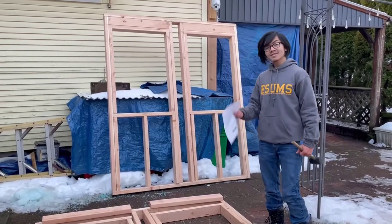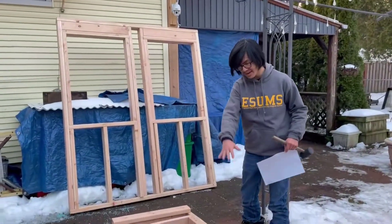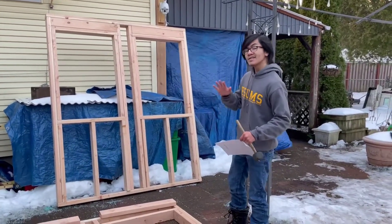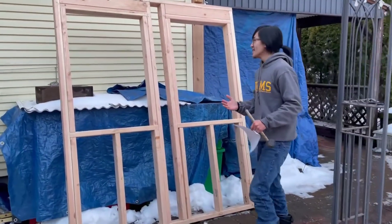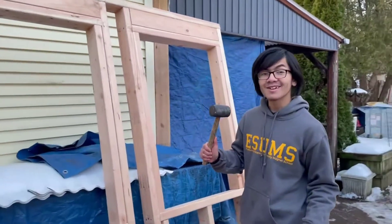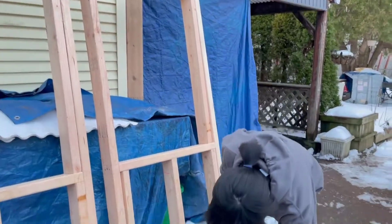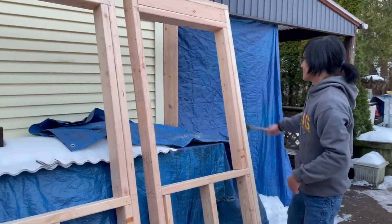So the plan is to install these frames. Right now we could have everything nailed in and set to go, but when my dad built things he usually built them with the foresight that he's going to have to do things alone — which means he needs to carry things and keep them as light as possible. So he designed this frame with the intention of carrying it by himself, meaning we can remove some parts to make it lighter. What we're going to do is knock out all the jack studs and then call my brother Azami to help, because we're going to put this into that wall.